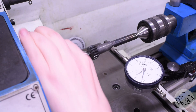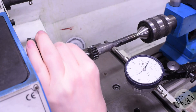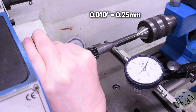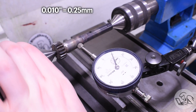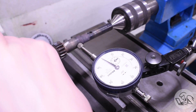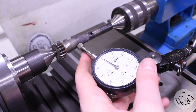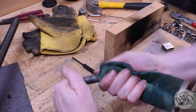The answer is yes — we took about 10 thousandths out of that bend, so this does seem to be working. I went and did another round of heating and beating and got another 10 thousandths out of it. I did a couple more rounds and this is about as good as I could get it — it's still got 10 thou of run out, but I went too far once and had to bend it back the other way, so I didn't want to push my luck. I decided to do a test fit in this state; if it's not good enough I can try again. The torch makes a mess of the part and I need to get it cleaned up because those ground surfaces need to be shiny to run in those bearings without chewing them up.